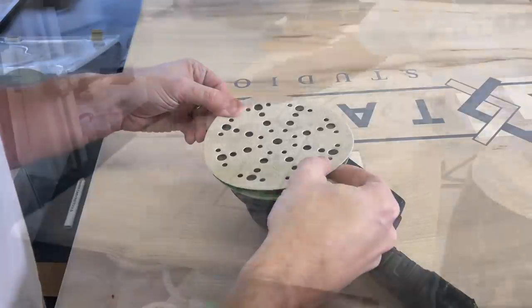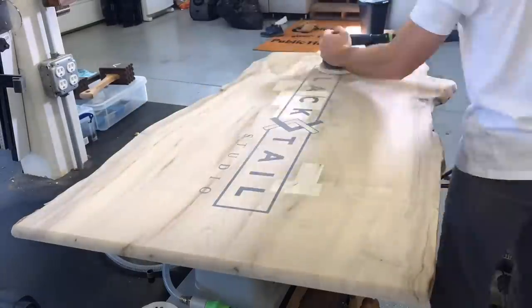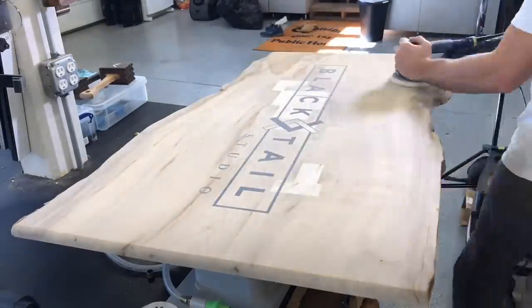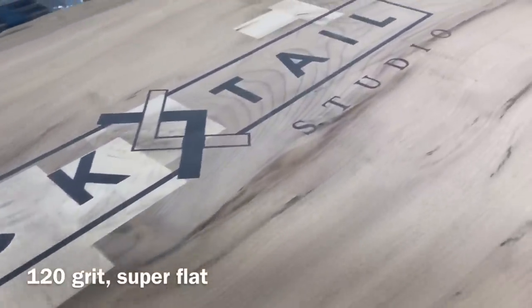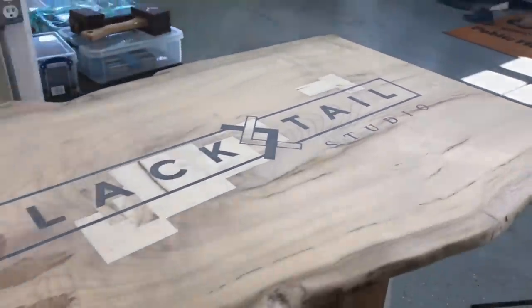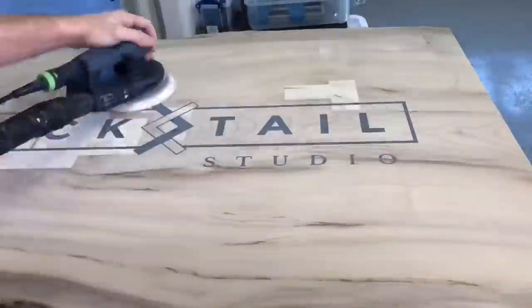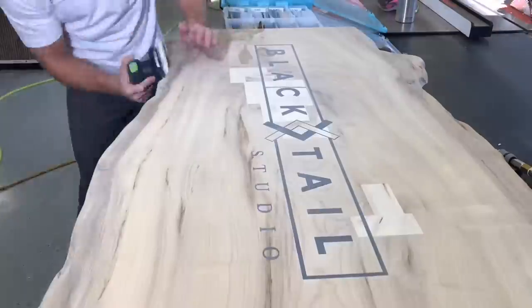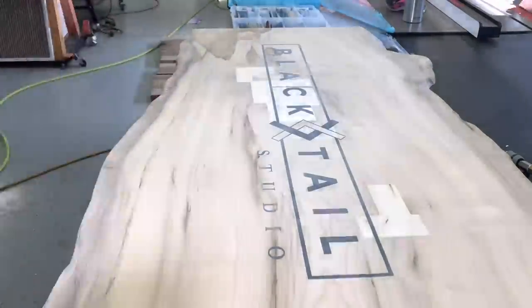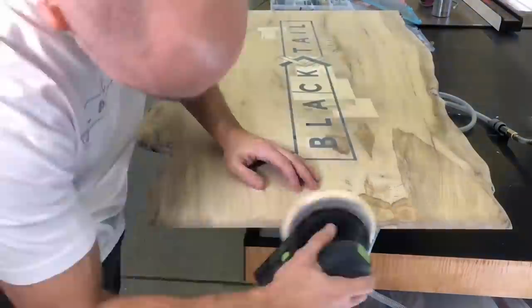I get asked a lot about what type of sandpaper I use. I find myself using Klingspor sandpaper a lot — it's pretty affordable and seems to last quite a bit longer than the Festool paper I normally use. Here's 120 grit — doesn't really look any different than the 100 grit, starts to feel a little bit smoother but doesn't look any different. Moving on to 150, trying to keep my sanding patterns even, alternating the direction. I only took the sides up to 400 grit, just as an FYI, because they're going to remain a little bit flatter.